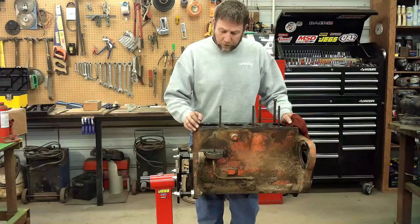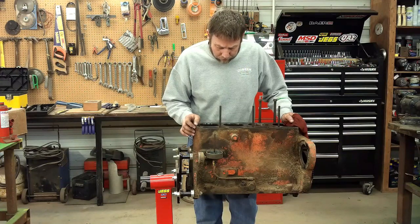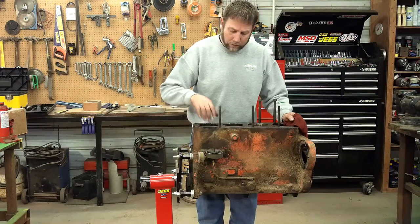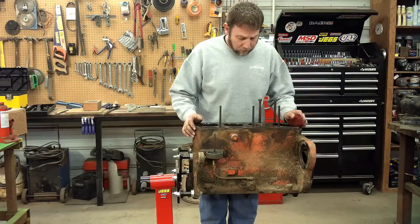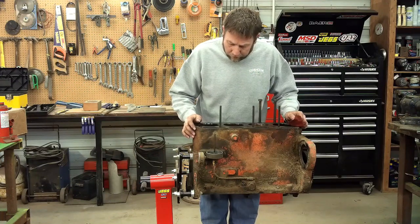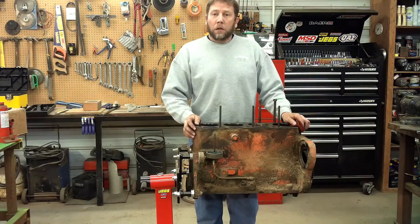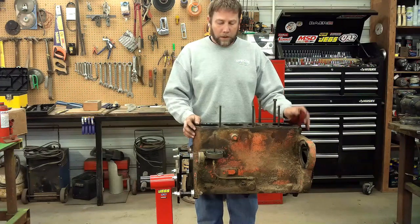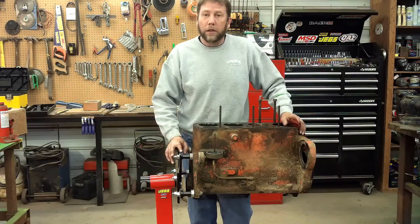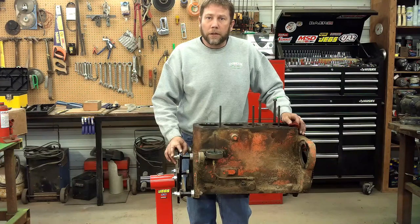I'm going to make my own sleeve puller and get these sleeves pulled out — it should be a pretty straightforward process. There are just O-rings on top and bottom. Get the new ones, put them in the freezer and they should pop right into place. We'll find out when that time comes. Thanks for watching — don't forget to subscribe and hit that notification bell. I originally planned on getting this running before doing anything else to the tractor, but with this turn of events I think we'll shove this aside for now and work on stripping down the rest of the tractor and getting it ready for paint. Catch you next time, bye.